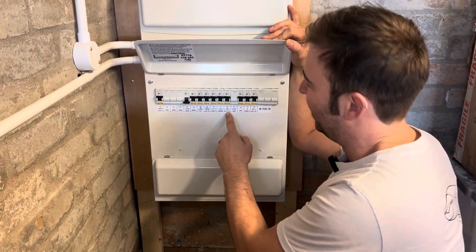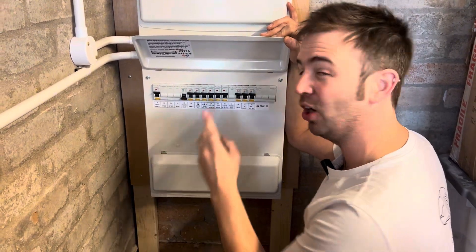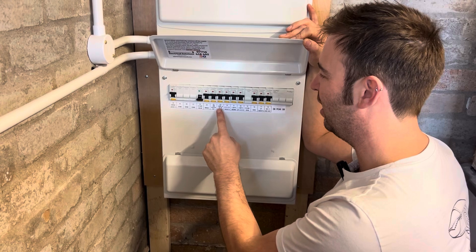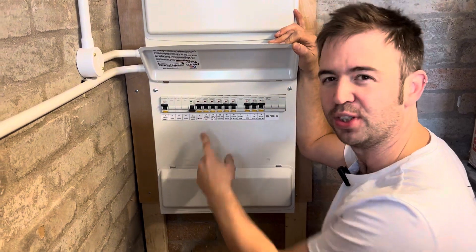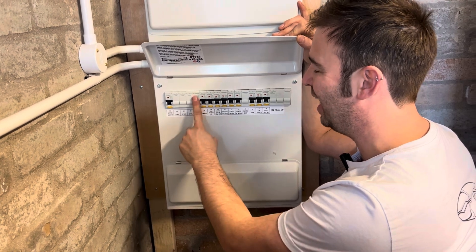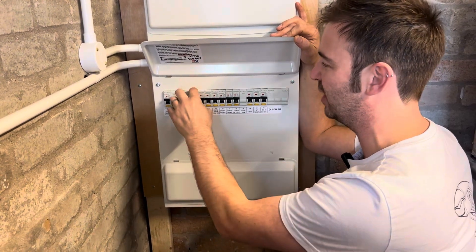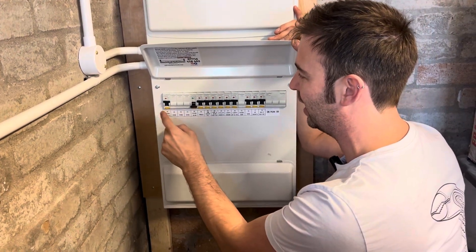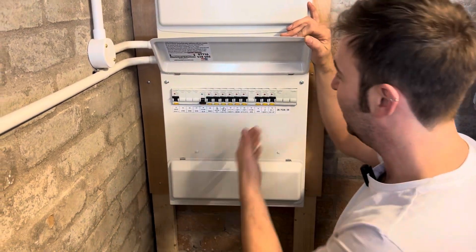There are lights on the ground floor, a utility socket — a dedicated radial for the utility. There's a pump and solar: a solar switch up in the loft and a pump for the immersion heater — a solar thermal supply — plus a three kilowatt immersion heater. Smoke detectors — I've done three. There's a future solar supply: a 6mm PV cable up into the loft, isolated and not connected to the RCBO yet, ready for the client. There's also a dedicated radial for the garage, which via a fused connection unit also does the lights.